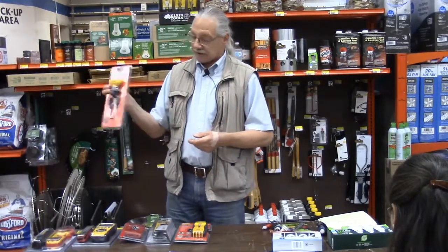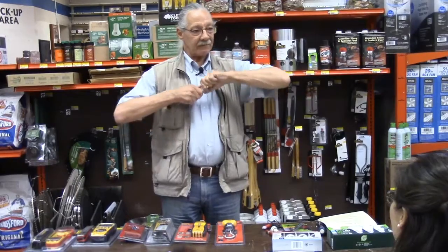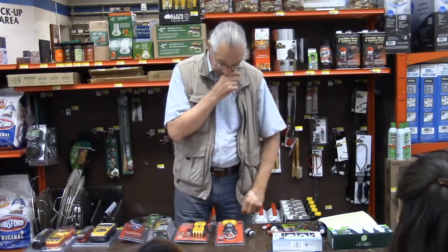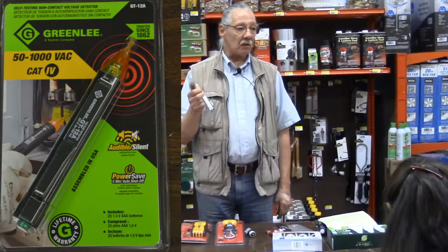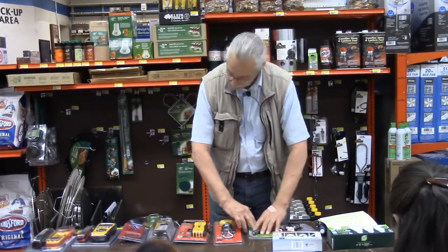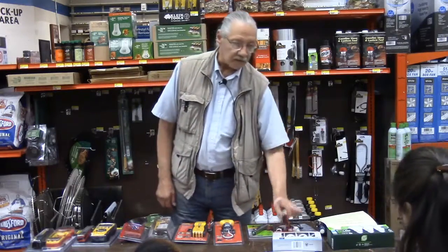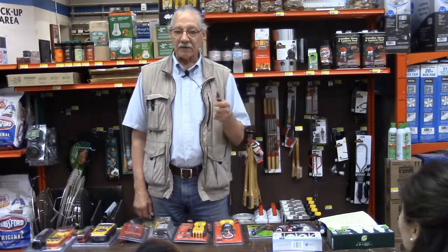This adapter is made by the factory. If you just want to test the light bulb, this is two pieces — a simple adapter and a screw-in plug adapter that does the same thing. And then we have the non-contact testers. You don't have to be touching the wires in order to measure the voltage. Whereas with most meters and the solenoid tester, you're going to have to plug it into the socket or touch the wires with the leads. This won't tell you what voltage you have, but it will tell you whether the circuit's live or not just by its beeping.